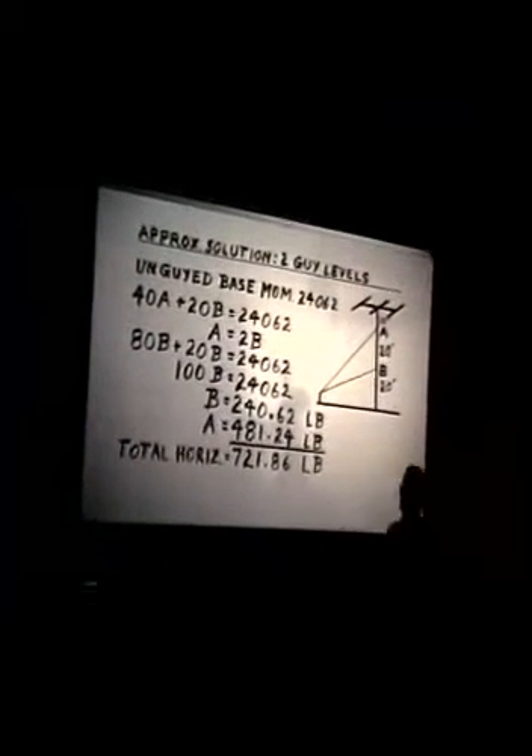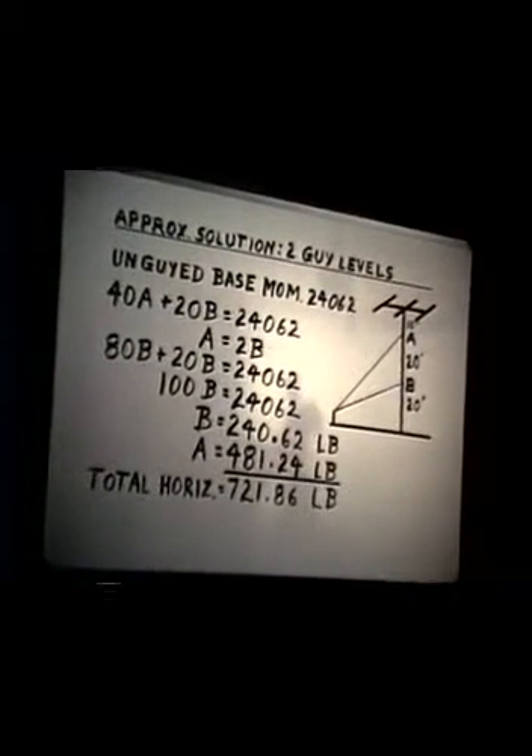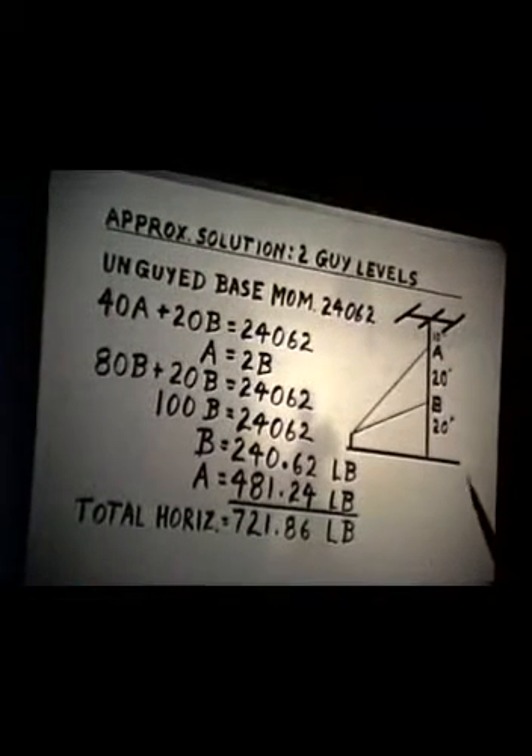You will see that same kind of situation on the hinges of a door — a hinge up top and a hinge down below. If I ask you how much of the door's weight is going to be on one hinge versus the other, well, who can say? It depends on the exact spacing of the hinges on the frame of the door. It's not a calculable thing — it is a statically indeterminate system. The only way you can approach it is if you knew the elasticity properties of the door and frame and the exact spacing. We don't try to calculate things like that.